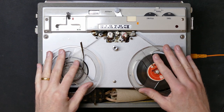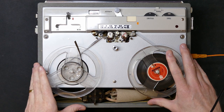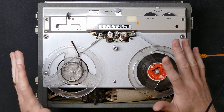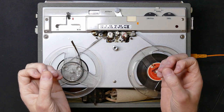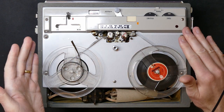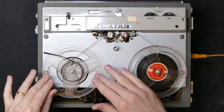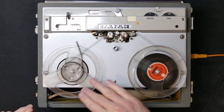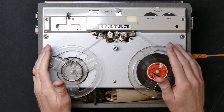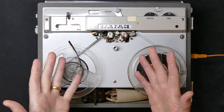Here's the read head — at the moment it is not engaged. If we push play, it engages and you can get sound, but it's quite hard work moving the tape because the capstan is engaged. I'll bypass the capstan by moving the tape over here. Now it'll move quite freely and we can play the tape manually without any amplification in the device itself. You can vary the playback speed — moving it slowly gives a deep tone, and it goes higher the faster you move.